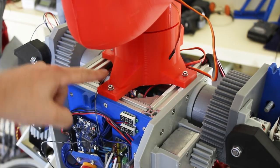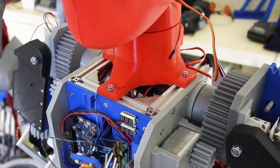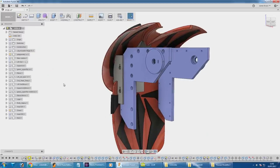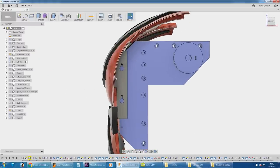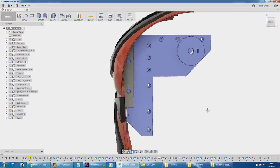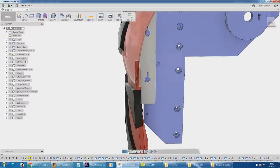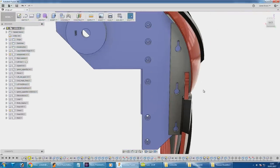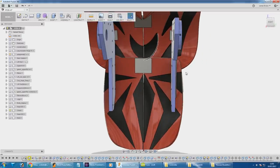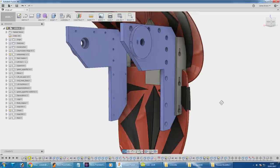I've mounted the head and it fits where I planned it to. I've had to take the emergency stop button off the front - it's going to be hidden behind the chest panels anyway, so it needs to be relocated. Now we've just got to make some brackets to put those chest panels on and see how it looks. I've made a couple of brackets to hold the chest plate - there's one on each side. One side is slightly longer because the bottom screw hole on that side is used for the potentiometer that measures the body lean front to back. I've put keyholes in so they fit to existing screw holes, but we can lift the chest and ab plate off in one piece to get to the electronics below. There are a couple of joining plates in the middle to make sure it's not too wobbly, and those have had the actual panels subtracted so they fit the contours perfectly.